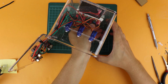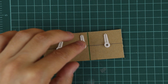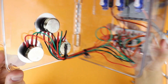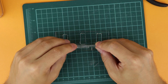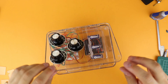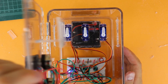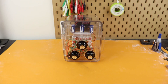Now I can connect the servos and give this a try for the first time. It's time to make the lock — I made cutouts for the little servo arms, gave it a try to check the fit, and added a cable guide to keep cables out of the way. To fix the locking mechanism in place, I glued another piece of acrylic to it and then glued the whole assembly in place by closing the lid — that glued it exactly where it needed to be. There were some clearance problems but a few files took care of that, and in the end everything was working as intended. I added some feet so the safe could stand, and after a whole lot of work the safe was done.